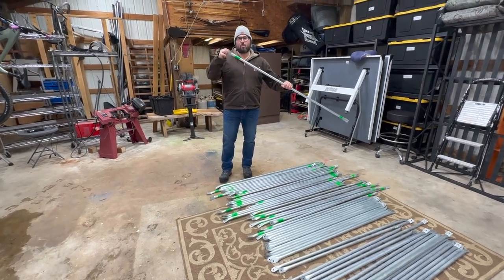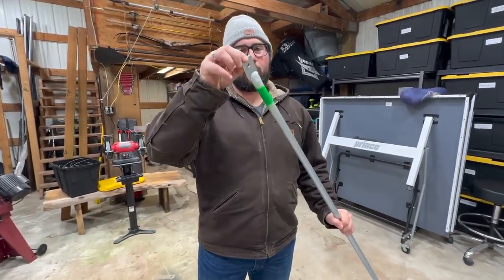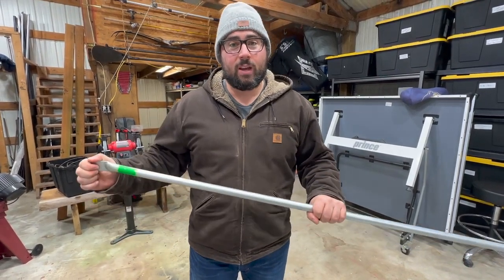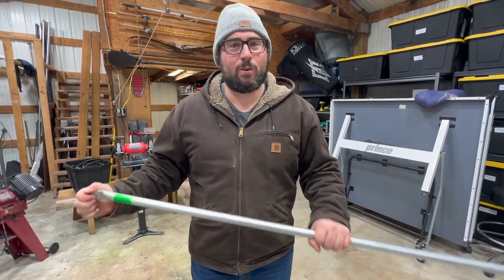These have been put through a hydraulic press with a custom die that was welded. They've gone through a drill press to punch a hole in them, and that will be used to attach all these struts together. I'm going to go ahead and do this by myself, assemble the dome, take a time-lapse, and see how long it takes. Stay tuned for another update.